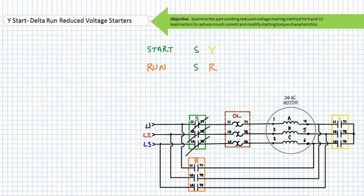When the Y contactor opens, it breaks the Y configuration and primary current stops flowing — this is the open transition. Upon closure of the R contactor, winding A is connected line-to-line from L1 to L2, winding B from L2 to L3, and winding C from L3 to L1. This already spinning motor is now in a delta configuration, such that windings A, B, and C experience the comparatively higher line-to-line voltage. Note the R contactor doesn't necessitate an overload, since current through each winding will be experienced by the overload already in the circuit. The transition time between the opening of the Y contactor and the closure of the R contactor makes this an open transition reduced voltage starter, because the motor windings are momentarily de-energized during this period.